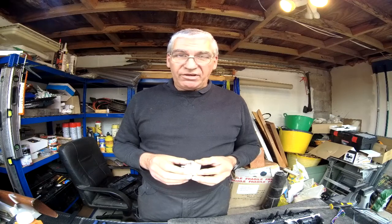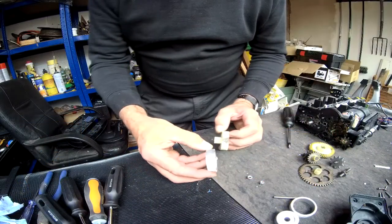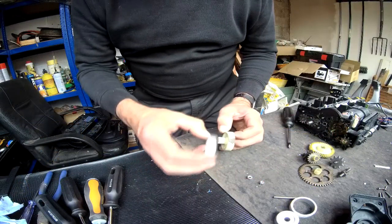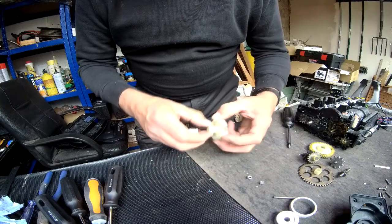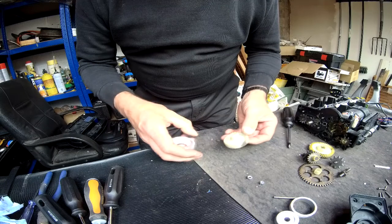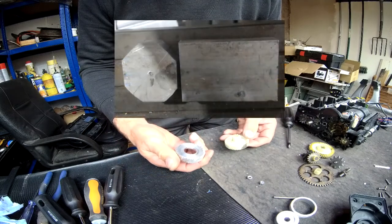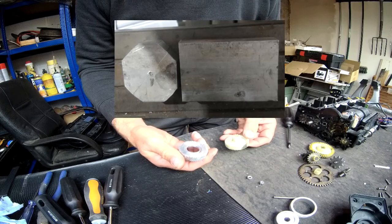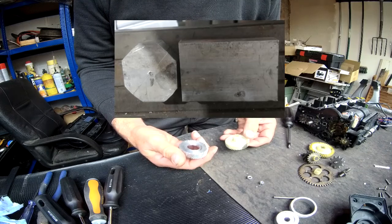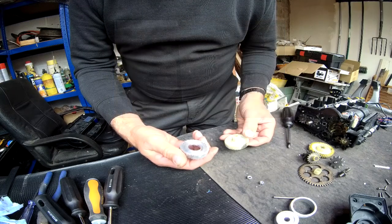I'll talk you through it very briefly. I'll just reposition the camera so you can see better what I've done. So what I've done is I've made a replacement gear section, or I'm making a replacement gear section to replace just this part of the gear. So the first thing I'd have to do was cut a piece of stock material to make that out of, which the only thing I'd got was a piece about 5 inches long of 50 by 20 mil thick aluminium